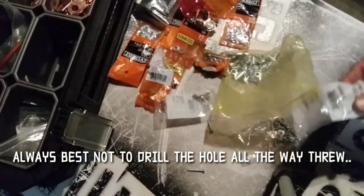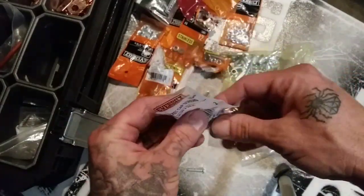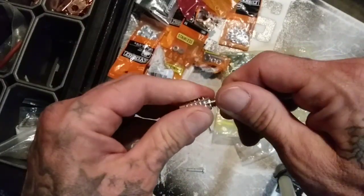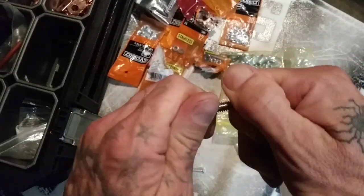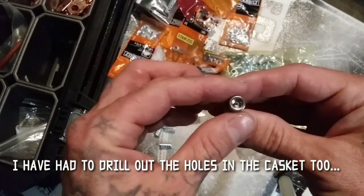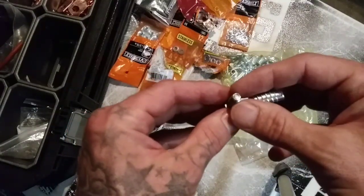These are the bolts I use — they're quarter inch. These Allen head bolts are about 80 cents for two, so always grab a bunch of extra packs, only a couple bucks. I like using these because the nice round head usually fits right in the hole in the gasket of your subwoofer. You do usually have to drill out the basket on your sub a little bit though.